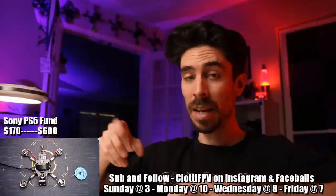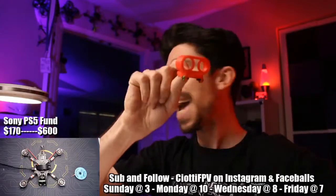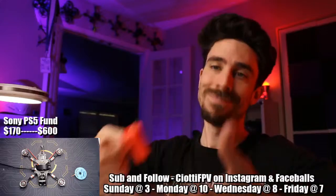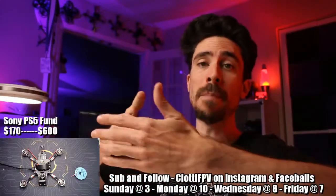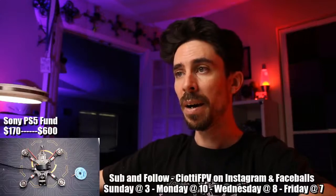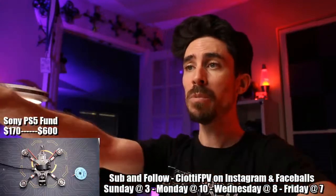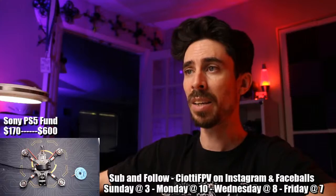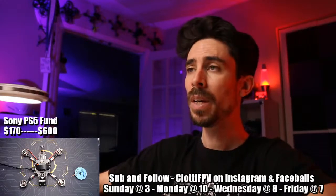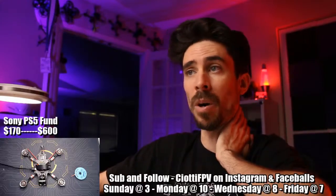And the other thing is, like I was saying before, this rig is set up to also carry an Insta360 Go 2 up front. If this had that 26 gram HD camera with another 5 or 6 gram mount, we are going to start shifting that balance of weight on the pitch axis versus weight on the roll axis. So just for the sake of not having to change PIDs whether or not I take that camera off or on, I'm just going to move these pitch damping and pitch tracking sliders up a little bit. I'm going to move the pitch tracking to 1.1. I'm going to move the pitch damping to 1.2. Those are just numbers that I find to be in the ballpark.